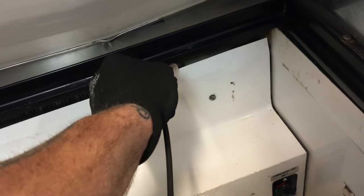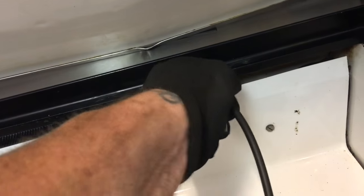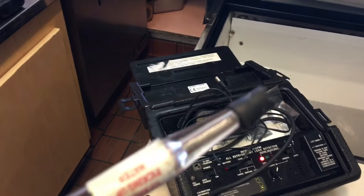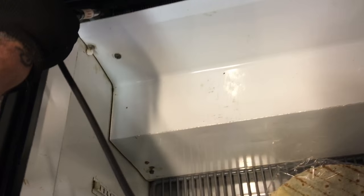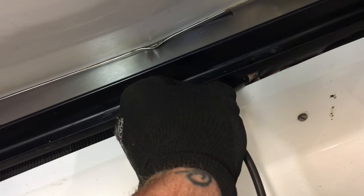And let me show you this real quick. So yeah, this stuff here, the H10's not made to pick up some test chemical from Yellow Jacket. But it'll pick up microscopic amounts of R134A that's mixed with nitrogen. As you can see. See it speeding up? Slowing down. Look at that. Coil's a big old weeper. There it goes.